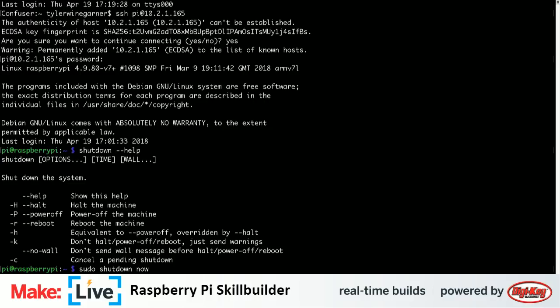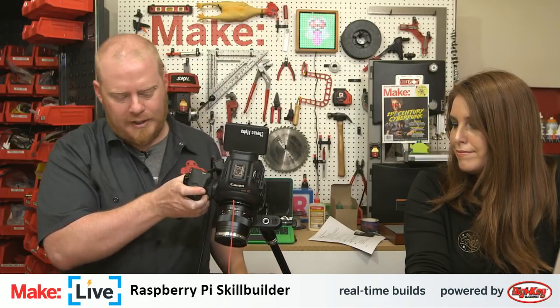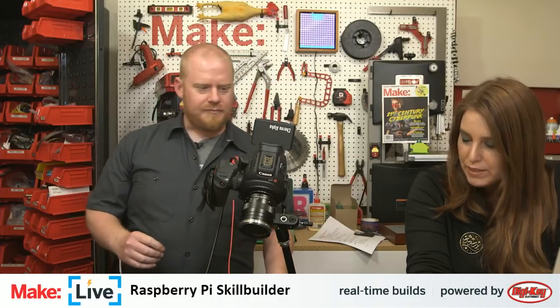So this project, come back to this camera here. Somebody realized at some point that by oscillating one of these GPIO pins on the Raspberry Pi, it would actually work as a radio transmitter. And it would actually broadcast on normal radio frequencies. This is one of the easiest Pi projects to do, both software-wise and hardware-wise. But it still manages to impress your friends and look really cool, and you totally look like a hardware hacker, even though the investment in it is very simple.